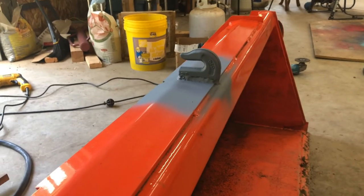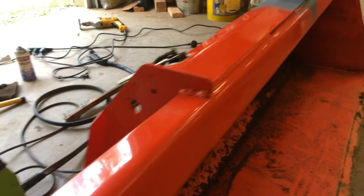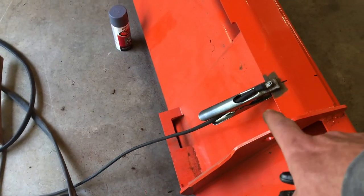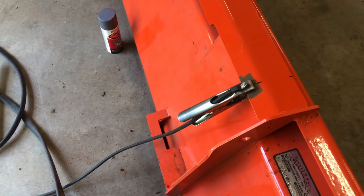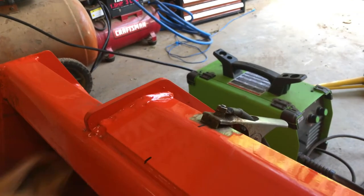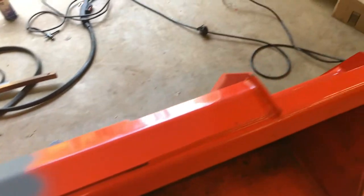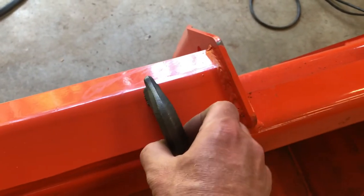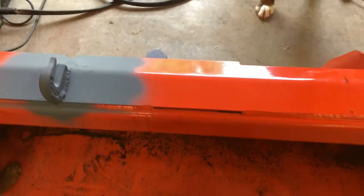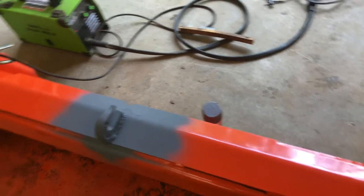Anyway, back to the bucket — I got one welded onto the center point, and then recognizing there's not a whole lot to weld to on these outsides, I was thinking about strength. Where the Bobcat attachment hooks in is right here for the loader, and I'm thinking the best area to maintain strength and get the full effect of the loader is on the edge here. As a novice welder, you've got this lip that you'll have a difficult time getting into to make your weld, so I measured three inches out on both sides. That gives me plenty of room to get the hook on there — two external points at about almost 20 inches, so 40 inches apart, right on the arms of the loader.